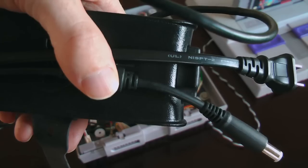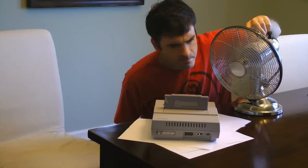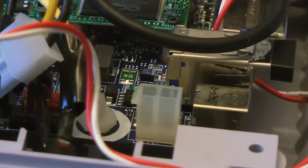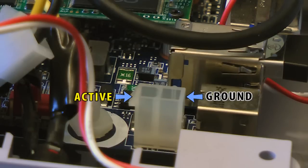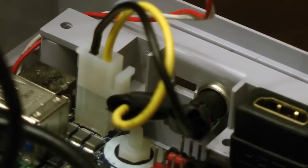I hit a brick wall — without a way to route power to the motherboard this was as good as a dead paperweight. Luckily, Intel was gracious enough to add a secondary extension for motherboard power through a 1x2 Molex connector. The setup is simple: one connector for ground and the other for the active wire. All I had to do was make my own Molex cable and route those wires to a DC jack. This eliminated all the extra cabling of the Pico PSU and allowed me to make a customized cable that was a perfect fit for the enclosure.